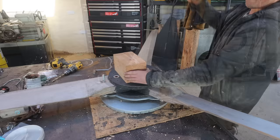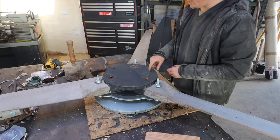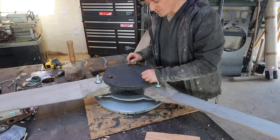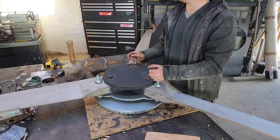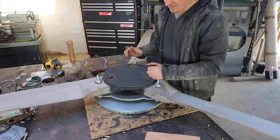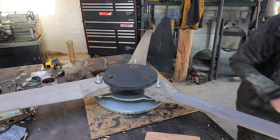Quite an interesting problem to deal with today. I don't know if I'm going to be able to put this up, because it's currently windy enough to make this do a kilowatt. It's also been raining all night and wet, so the hydro's going at full tilt, and we've got 4 kilowatts of solar coming in, and I actually don't have anywhere to put the energy. If I was to turn on everything the inverter could do, I still would have more energy than I can use. So unless I actively switch the solar off, there'd be nowhere to put this power. So I need to address that situation before I put it up, really. There's just too much energy coming in.